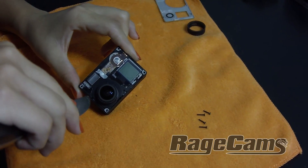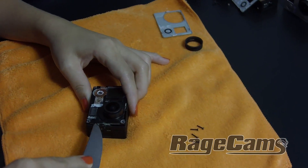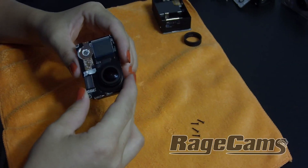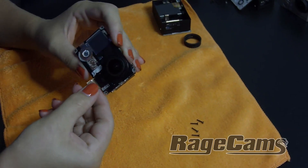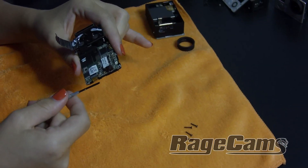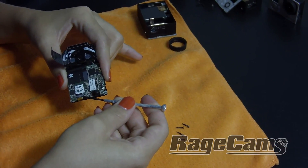Using the knife, we're going to pry up the board — it's a little difficult but not impossible. Once again, if you don't feel comfortable doing it, we'd be happy to do it for you. Once you change the lens and break the glue seal, you'll be able to change lenses on the fly anytime you want. It's always best to use a monitor when focusing the lens. There's a little ribbon cable right here that needs to get pulled out.